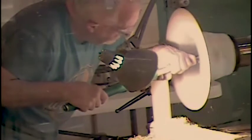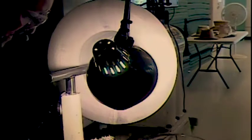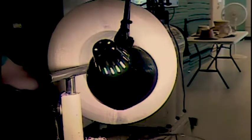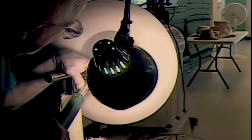Just get rid of that torn-up grain from the roughing end. Take very little at the very top because that's the height we like. Don't really want to go any higher. I have a little carbide disc tool that I can use in there to rub the bevel to get it smoother, but I don't have it with me. There's a limit to how much I can haul. I'm going to try to make it just a little better with the half inch. And I've got to get rid of this hard shoulder here. That's got to round over a little bit.